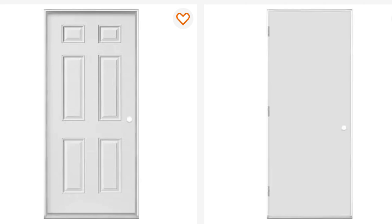A couple of bonus tips on end walls, primarily about the door. Many people — especially with DIY options — will buy a pre-hung door to save time, and that's better than constructing one out of two-by-fours, which tend to get heavy and sag over time. Just know that although the door itself is metal-clad and designed for exterior use, the door frame more than likely is not — it's designed to be hidden behind sheetrock and siding. Make sure you treat that door frame with high-grade paint to keep the elements off of it.